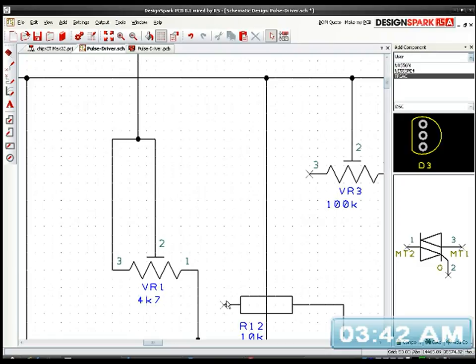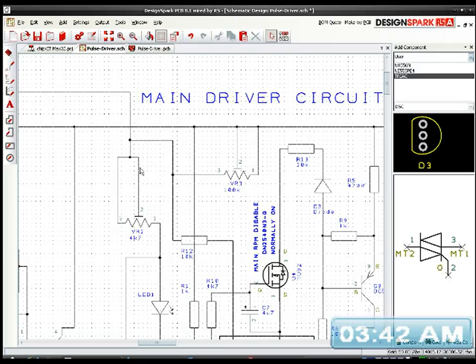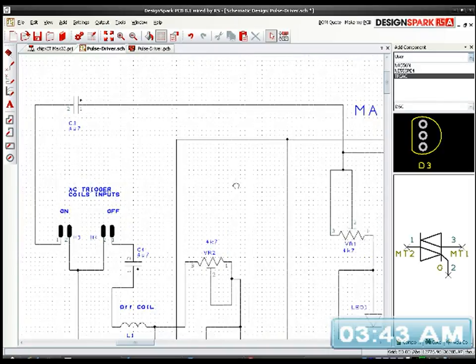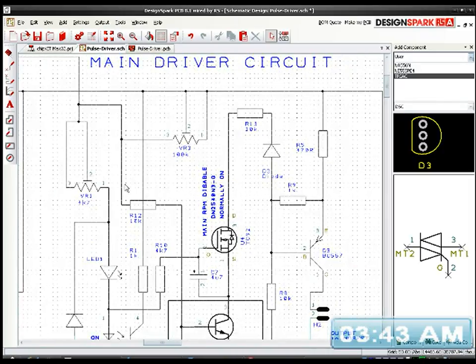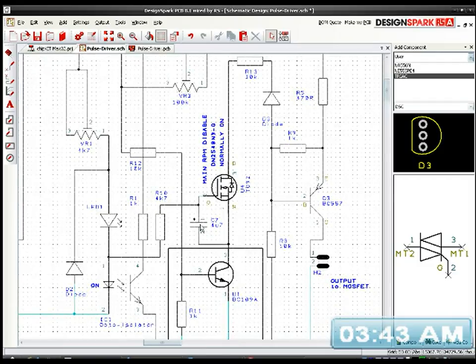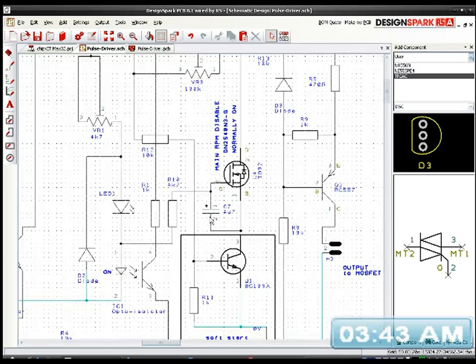Just a minute, I'll just tidy this up. No, that's it. But I don't need two of those capacitors in series with it, because they're effectively in series. So now this trimmer is connected through that resistor. So we're isolated in the fact that we have this other capacitor up here. So we don't have to worry about extra decoupling on there. Having two in series was a bit silly, really. Well, that's because I'd been a little bit too overzealous with my safety side of looking at it, not trying to blow anything up, trying to avoid that. Right. Let me just check everything else. You see, as I'm going along, I'm noticing things which need to be fixed before I can go further on, you see.